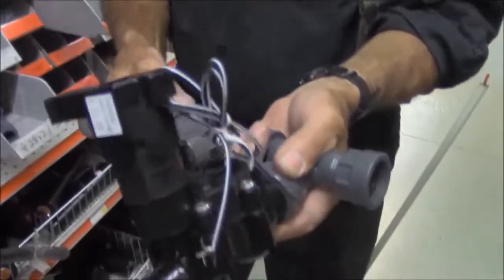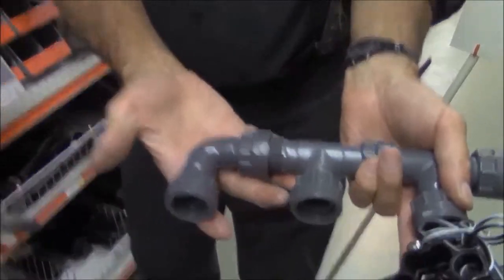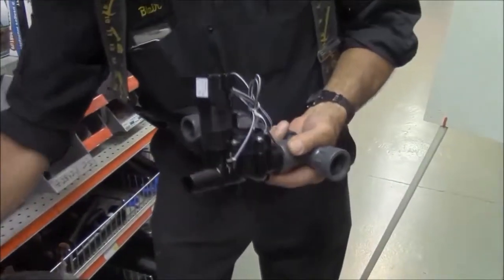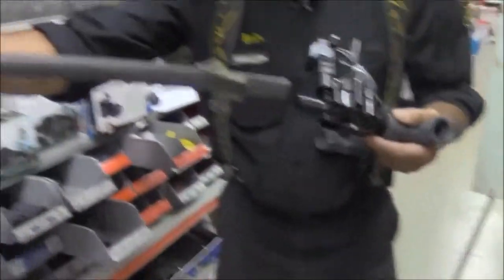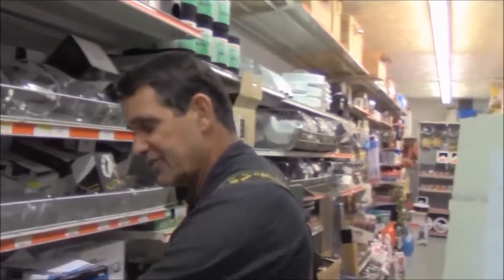At the very end, I put a 90-degree fitting, and now I have a three-valve manifold. It's slick and easy to repair. Usually I have one-inch copper or one-inch PVC feeding the three valves, and then I take one-inch semi-rigid poly line and go out to feed the different heads and zones. This new manifold is easy to build, unbuild, and add to — if we need another zone, we can just keep going along without wrecking the existing system.